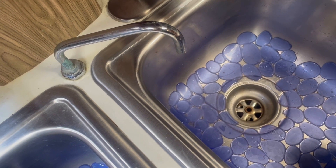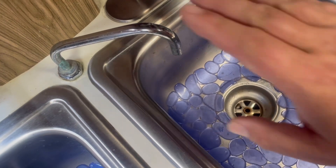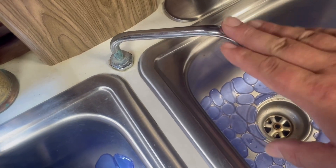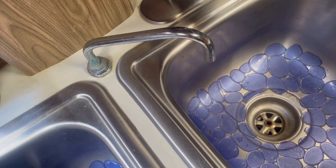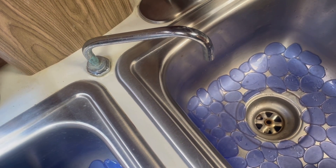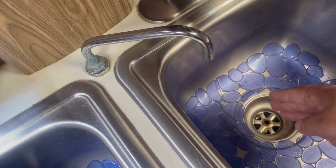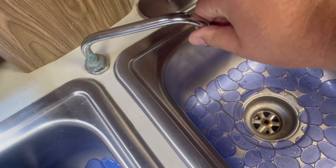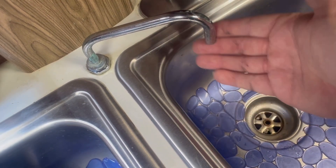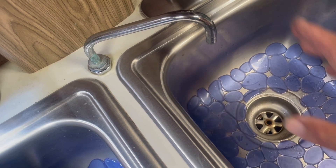We have this old spigot from a raw water pump that was used to bring sea water or river water onto the boat for doing the initial wash on dishes. It was replaced by the previous owner with a hand pump, so currently this spigot is not connected to anything. We're going to tie into the spigot as a discharge for the gray water coming out of the bathroom, using a pump to discharge into the sink drain and then overboard. We create an air brake using the space between the sink basin and the spigot so there's no risk of ocean water coming back in.